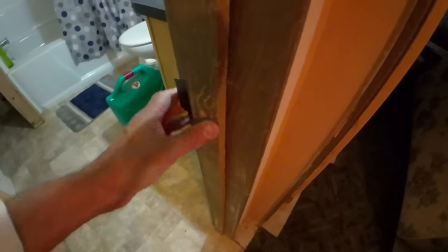If the door ever warps, you can take the door stop off and adjust it. In this case none of the doors warped. There are bunk beds in there as well. What I love about the Quonset structure is it gives you a nice big channel for air to flow through and up upstairs — there's no stagnant air anywhere. I'll tell you without a shadow of a doubt, that place smells brand new. No condensation whatsoever, no sweating — and the reason it doesn't sweat is very specific: it comes down to how I do the insulation on the outside.